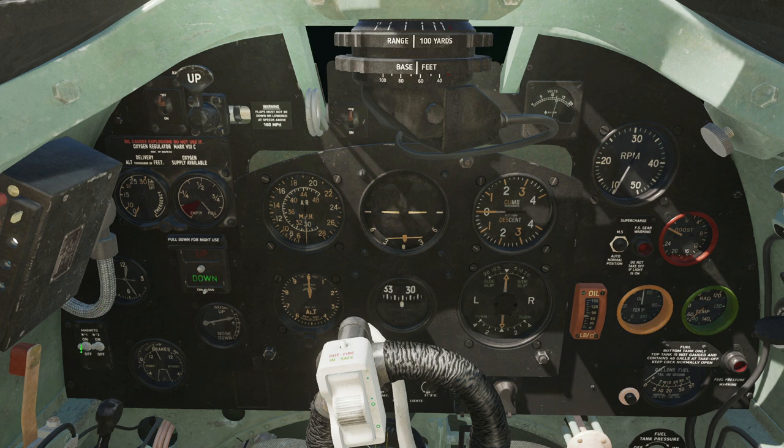Magnetos, one and two — we can have each of them on or off. Hydraulic and pneumatic systems. A little hard to see, but if I pump the brakes you can see: left brake system hydraulic pressure times 10 PSI, up to 130 PSI, and the same on the right up to 130 PSI. And then we've got the pneumatic supply here up to 600 PSI. You can see we reduce pneumatic slightly when we use the brakes for the hydraulics.